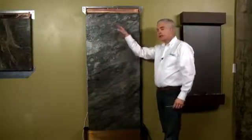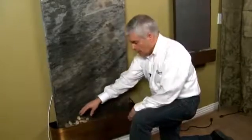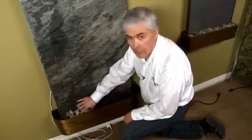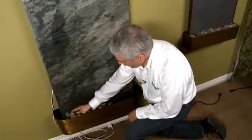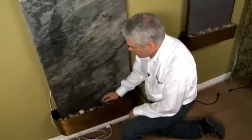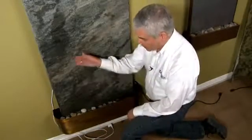Then you can turn the water back on and see if the water's flowing smoothly over that point. The most common cause we experience for splashing takes place right down here on the tray — on the pebble beach tray where the pebbles are. Splashing generally occurs when the pebbles on the shelf are leaning up against the water feature surface itself. The water is coming down the water feature surface and hitting the pebbles and splashing out onto the floor. So you want to pull these pebbles so that they're not against the water feature surface.